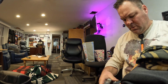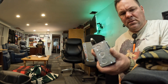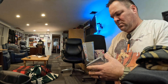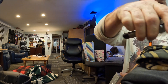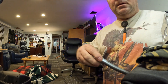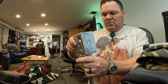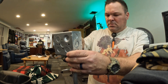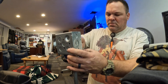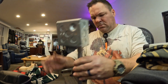I'm a big fan of assembling whatever I can in the upright position rather than on the floor. I'm going to knock out my knockouts from this four-inch square deep box — I wish I had a shallow box for this application, but I don't. I take out the knockout, put my EMT connector on, and connect it to my conduit. It's already been measured to the other end of the EMT with a coupling between them.